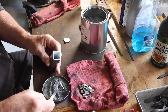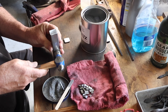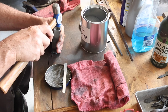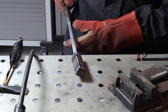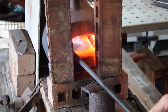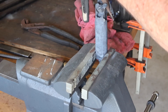Using a 1-inch canister, making canister damascus out of the saw chips along with some scrap steel I had and some powdered steel with nickel silver in it. Got that all put together, welded a handle on it, and put it in the forge and went to go forge out my billet.